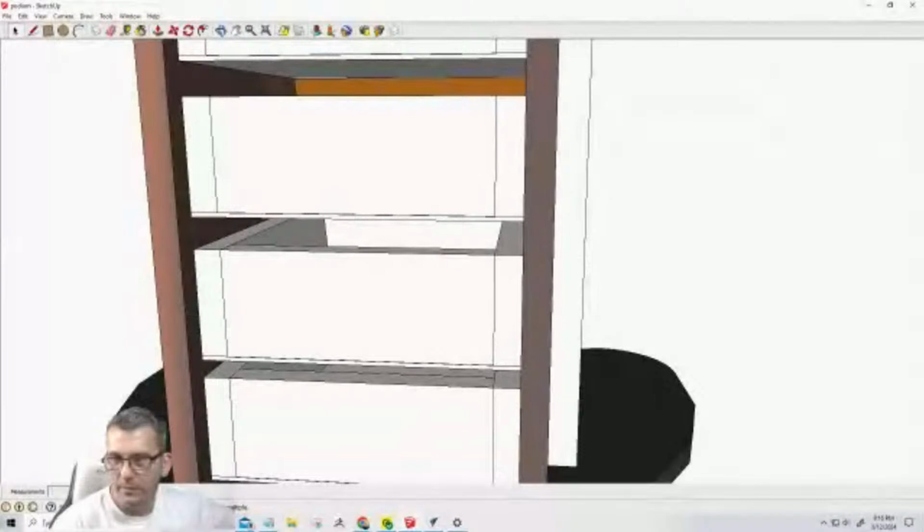So I also like a 3/4 inch drawer as well. Now this one is just select pine. The fronts and the backs are pocket hole, and then the bottom is pocket hole in, flush and everything. And then I'm using long reach drawer sides, and then my drawer fronts get screwed to that, of course. Now this is just one of my dresser drawers.